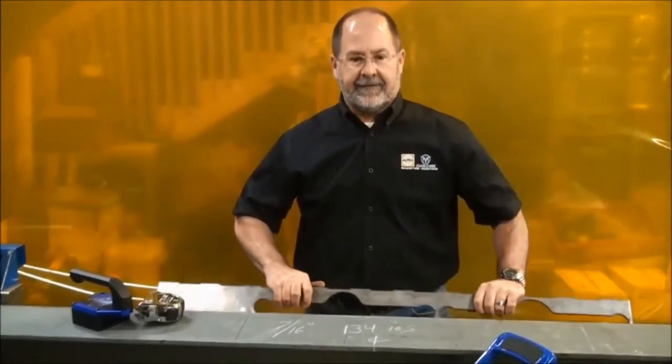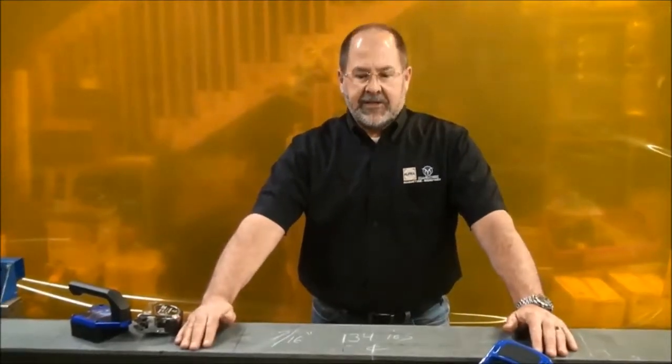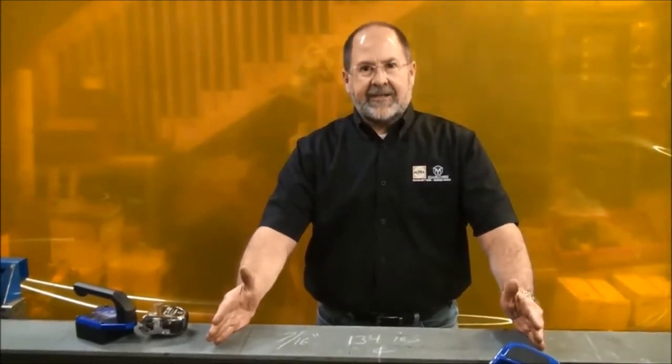The key to all of this is very simple: it's a test lift. We'll show you another video exactly how you do a test lift to make sure that the actual numerical holding value of that magnet on that piece of steel at that moment is enough to do the job safely — you're not going to get hurt. That's the whole goal we have here at Maglogix: to make sure you're lifting safely with a magnet that can do the job and that you're always holding on to the piece of steel.